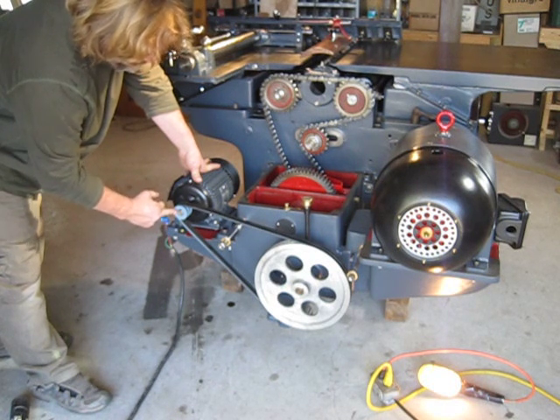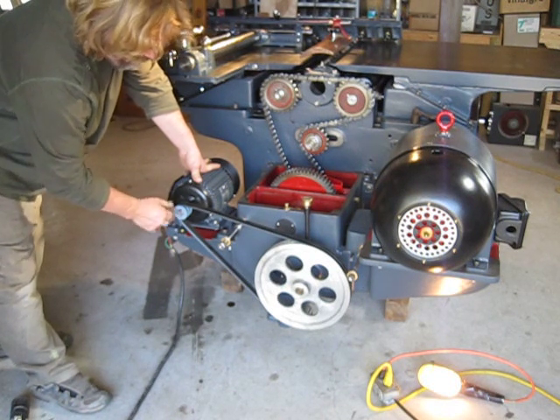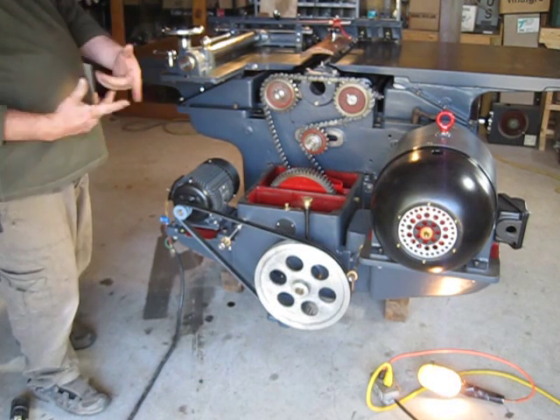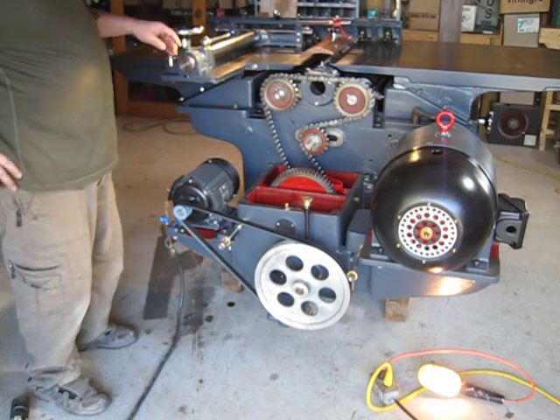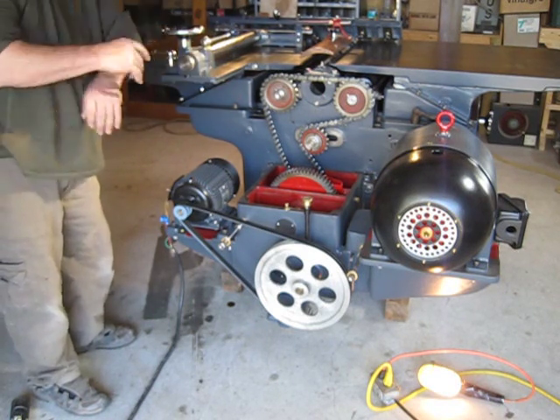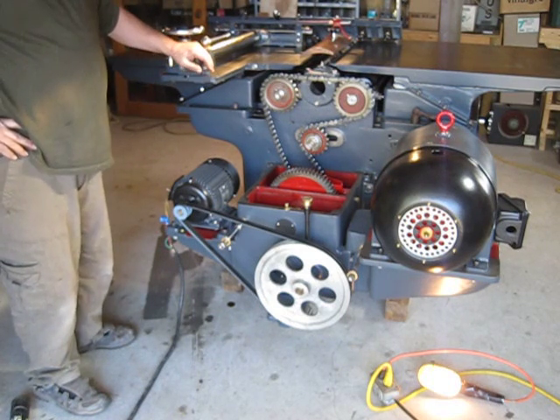Very hard to find — a seven-eighths bore two-inch pulley. Put in two matched cogged belts. So I should be running that at 300 revolutions, which is what I calculated.